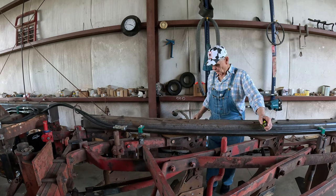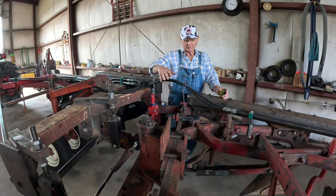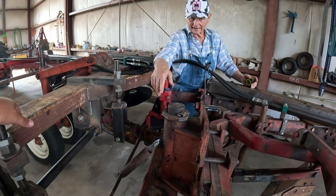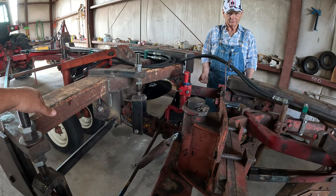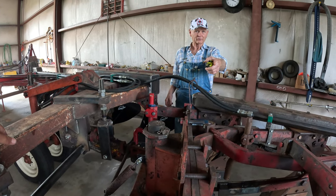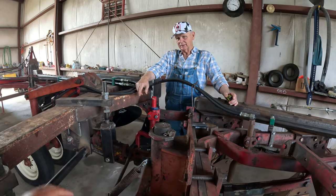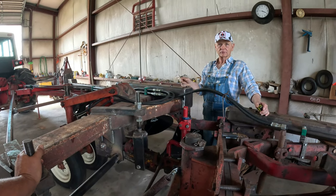But you see, the way to weight these plows, all your plow weight, I know a lot of people know this, but those that don't, I'm going to tell you, is really right through here. And what happens, it puts most of the weight right on this side right here. I can, with none of the weights on there, get on that side and actually work it inside the thing a little bit and feel it go up and down. So there's hardly any weight on that side, and that's why I put them over there to help out. I did have some up here experimenting. I said, this is just getting too heavy, and I got to think of something. And anyway, I found out with my OEM tractor with down pressure on it, we would just push it right down.